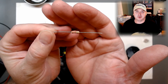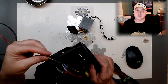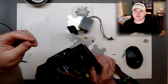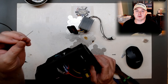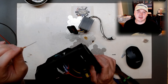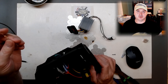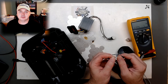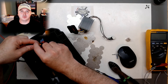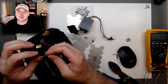Here I'm just going to put a resistor for the lighted switch — it's a green LED rated for 12 volts, so we need to drop 48 more volts, about 60 volts total. Using Ohm's law: 48 divided by 20 milliamps gives us around 2.4K. So this is a 2.2K resistor — we'll double check, looks good. We'll put some heat shrink over it.